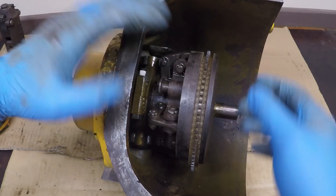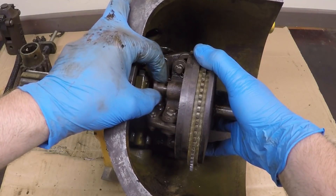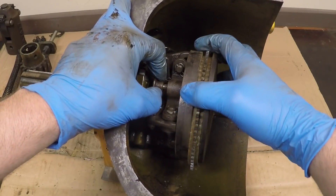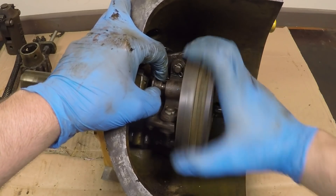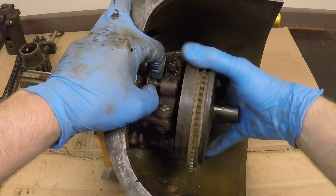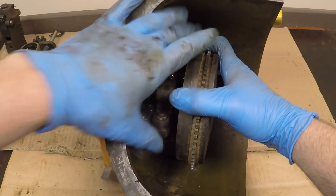So we're going to pull it out so it completely disengages from the rear pressure plate, then thread that spider all the way off of the threads that are on this plate. There we go — it's loose.